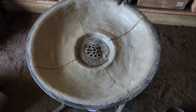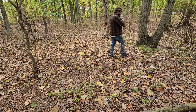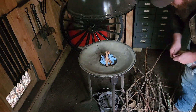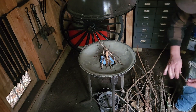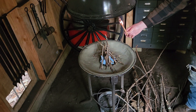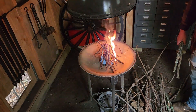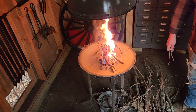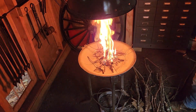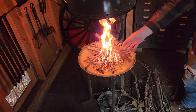Let's go get some firewood. Now we're just going to start a fire in here to dry this out the rest of the way. You're going to want to get it pretty hot and you're going to want it to burn for a while — you're trying to dry all this clay out. Plan to make a day of it; you're going to be there for a while.